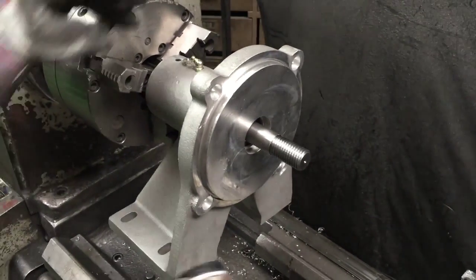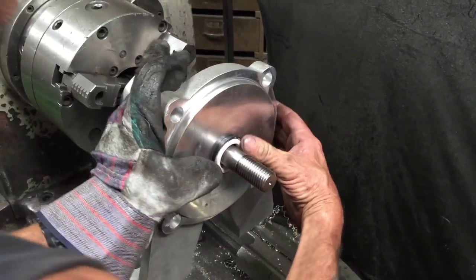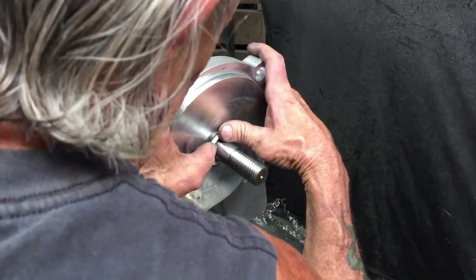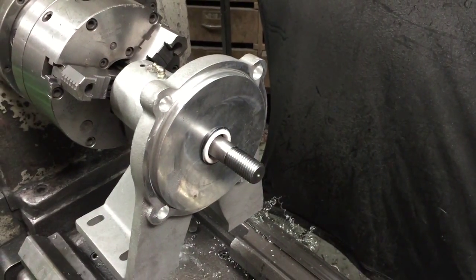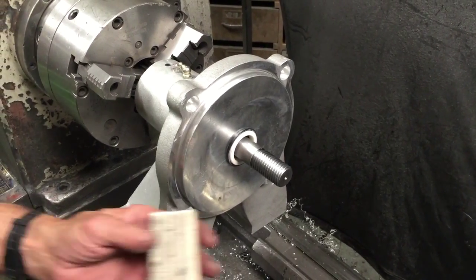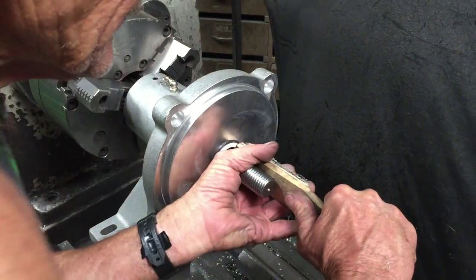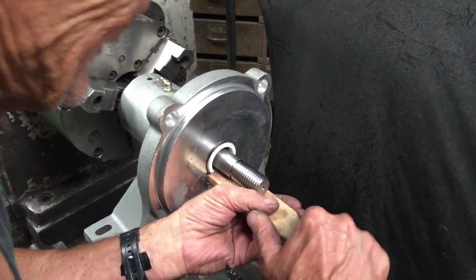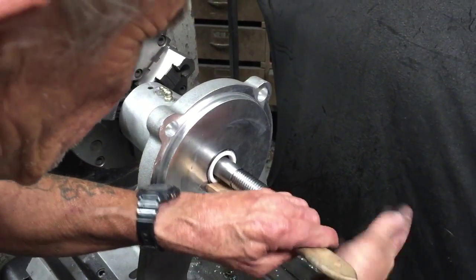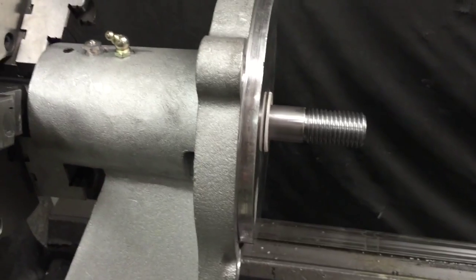He's putting in the white ceramic seal — this is the pump seal, the part that fails on the pump. It's very important that it's in straight all the way to the bottom. This is probably the most common thing that will fail on a pump. It's good to push with a block of wood or something soft so you don't chip the ceramic. If you do chip it, you've got to change the seal out. Look at it from the side — it should be nice and straight.